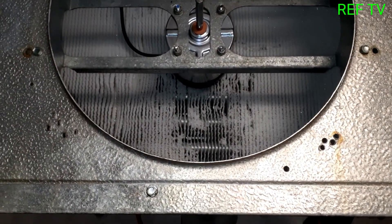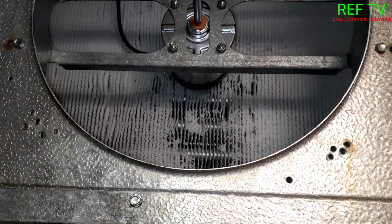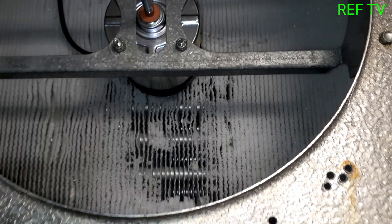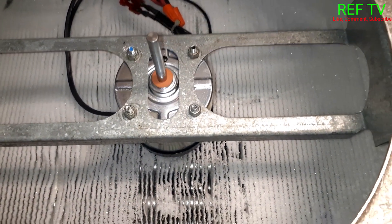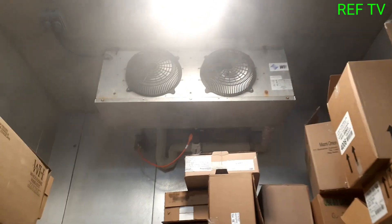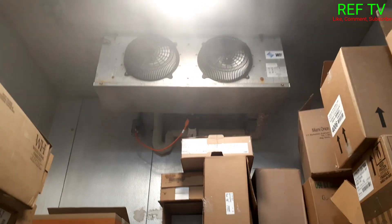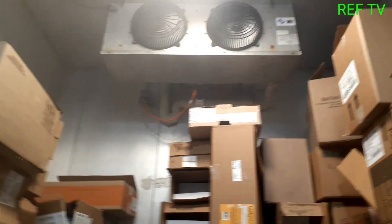Motor's back in place — let's flip it on and see if it turns. No smoke — we're running! Let's kill the power, put the fan blade on. Now we're back on with both fans running, spinning in the correct rotation. We've got a little bit of ice on the coil — we're going to run up to the roof and put it through a defrost.